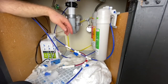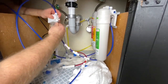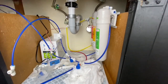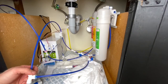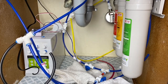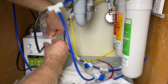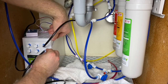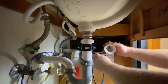What I decided to do was build a bypass for the system, because I have things hooked up with the RO/DI flood guardian and everything has to go through the solenoid. I wanted to make the bypass so that when I need to fill up a brute trash can for water changes or want water on demand, I have the ability to do so. Now that the bypass and flood guardian line are done and together, you route that to the top right section of the booster pump. From there you add line — water goes in through the top and comes out through the bottom — then route that line to the membrane cartridge entrance.